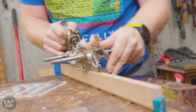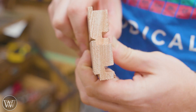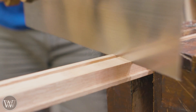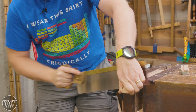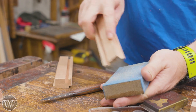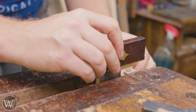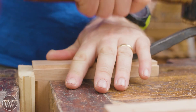The profile will have one small lip on the top that fits into a slot on the bottom, and then a groove on each to hold the plexiglass. I'm going to measure out one of these that is the length of a side of the plexiglass plus a little bit more so it will wrap around. Each side is going to have a butt joint connecting them — each stick is a little bit less than a half inch longer than the side of plexiglass. I'm going to need four of these per plate, and we need three plates, so I need 12 of these all together.